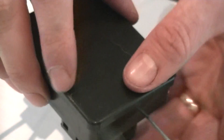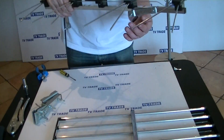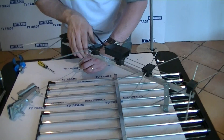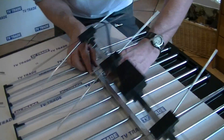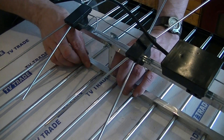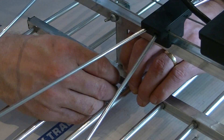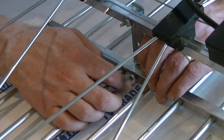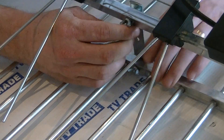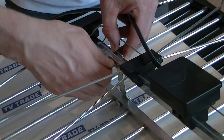We come along, get the cap, and squeeze it on like this. Now I'm going to pull the grid aerial forward — we have these two brackets here. I'm going to unscrew this first set of wing nuts, and we're going to join the dipole together with the actual aerial. We slide it in and put that wing nut in there, then repeat the same process on top to give a bit of stability as we're tightening it in.